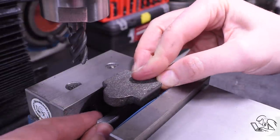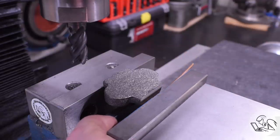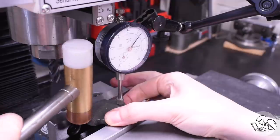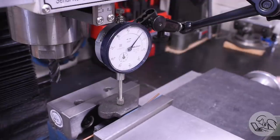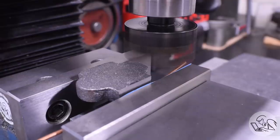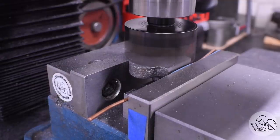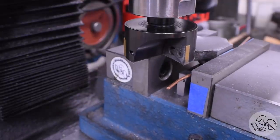Back into the mill now. I'm going to face the bottom - I got rid of the emery paper on the fixed jaw because I've got a machined surface there, but I'm using copper wire on the other side because those surfaces are not likely to be parallel. Using an indicator, I'm getting that cast surface roughly horizontal - you should be able to get it within 5 to 8 thou even with a cast surface. And then with that reasonably leveled, I can face this off knowing this machined face isn't going to end up too crooked relative to the cast details. My order of operations on all this has been pretty muddled - I apologize for that. I'm learning more and more about how to machine castings every time I do it, but I do a little better job here on the next part.